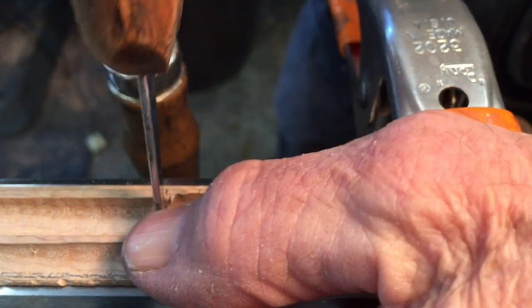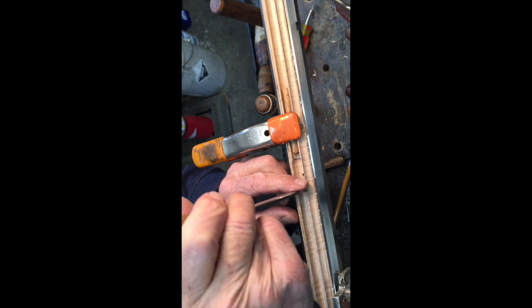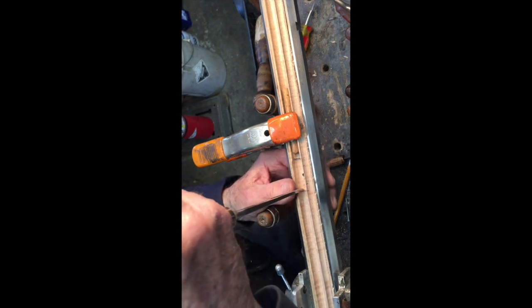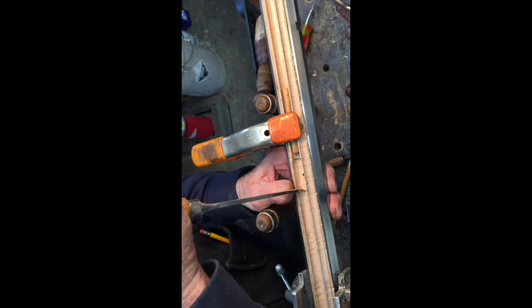I just make a cut on the bottom there. Now I'm going to have to raise that up so that I can get in here and work. There's no point in having the camera unless I can work. So we'll continue cutting this front edge a little narrower. And to get to the bottom here, just put a narrower chisel in there and rock it back and forth right on the line. That should be deep enough.